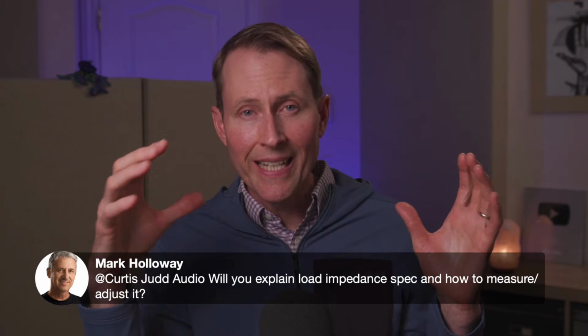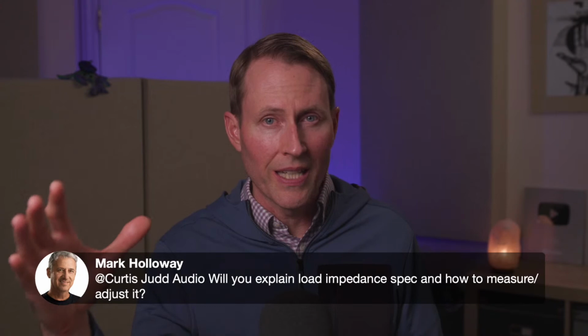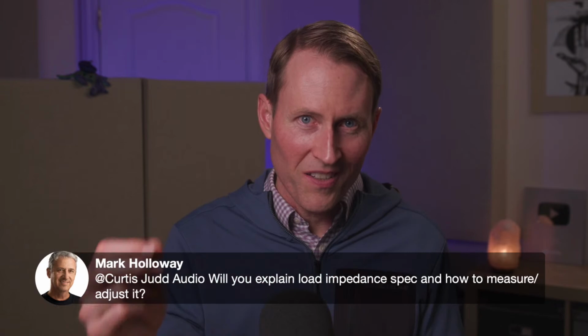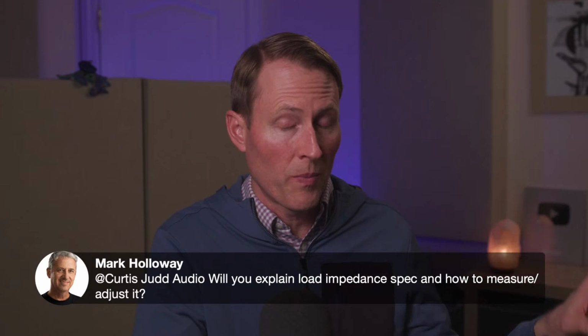So that's just one thing to keep in mind. For example, a lot of the higher quality gear will have an input impedance of at least 2,000 ohms. So that will handle pretty much any microphone optimally that has an output impedance of 200 ohms or less. Hopefully that makes sense. That's the practical implication. A technical description of exactly what it means, I'm not prepared to talk to, but that's my understanding of the practical implication of output impedance on the specs that you see for microphones and the input impedance specs you see for preamplifiers.